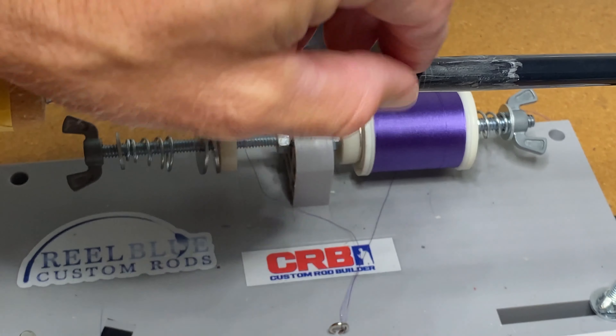So again, you can see in this video you can use 220 grit sandpaper — that really fine sandpaper — to take out blemishes in your epoxy work, or even go down to removing a decal like we did here. Then sand that out and build back up the epoxy layers. You can do it — it just takes time, and really what it takes is patience. I hope this helps. Please feel free to leave a comment below, and if you like what I'm doing, please hit the like button. If you have an idea for a video, leave a comment and let me know what you want to see and we'll make a video for it. Until next time, take care.